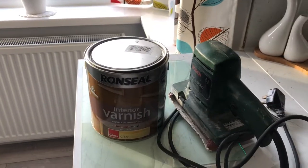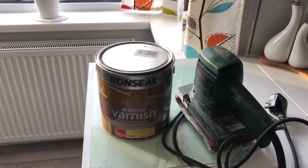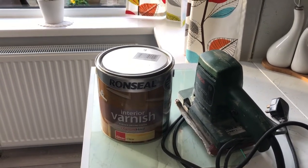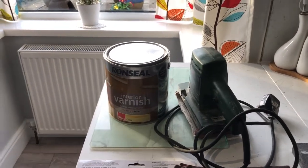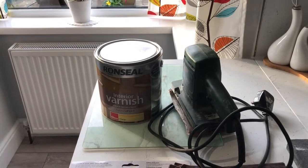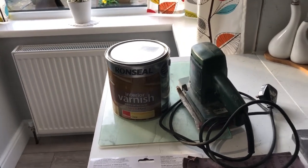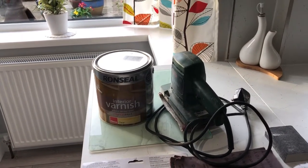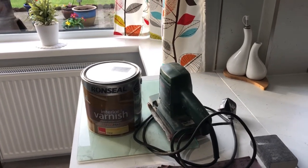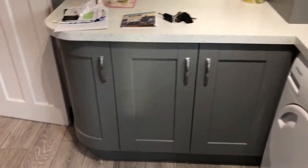Your preparation is the key — that hard work and elbow grease. You've got to sand down the floor, get the blemishes out, get the edges right, and then with the fine sandpaper get a nice smooth finish. Make sure it's all clean, tidy, and vacuumed up. Clean it off with a steamer or something like that so your floor is clean and dry, and then you can apply the varnish.